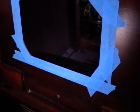I'm going to try something a little bit different to paint this off-white around here. Normally I would have masked off all the red mahogany, leaving the white exposed, and then paint it. But that'll be really tedious to cut around the curve of this screen. So what I want to do is tape it from this side, cover up the hole with some paper, and then try to spray the paint from the inside.